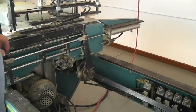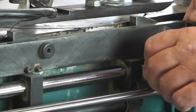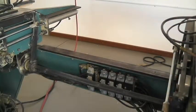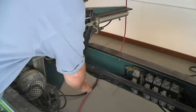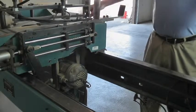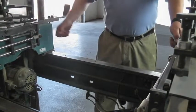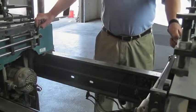On the movable end of the saw, push the feed all the way forward and position a penny between the feed stop block and the rubber washer on the movable side and hold it in place. Then push the stationary side all the way in to the rubber washers and lock the feed drive arm down. What that gives us is: when we hold the movable side all the way against the feed stop, the stationary side should have most of the play in it. And when we hold the stationary side up to the feed stop block, the movable side should have play equal to about the thickness of the penny.